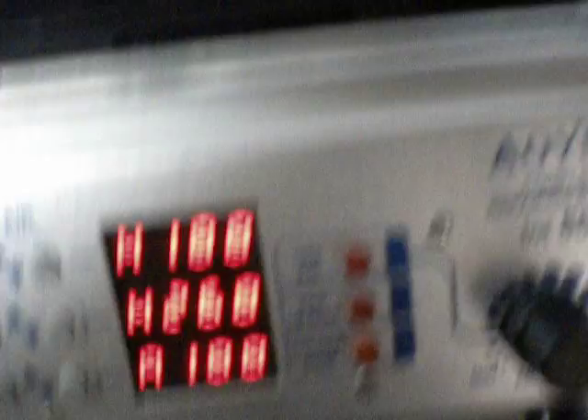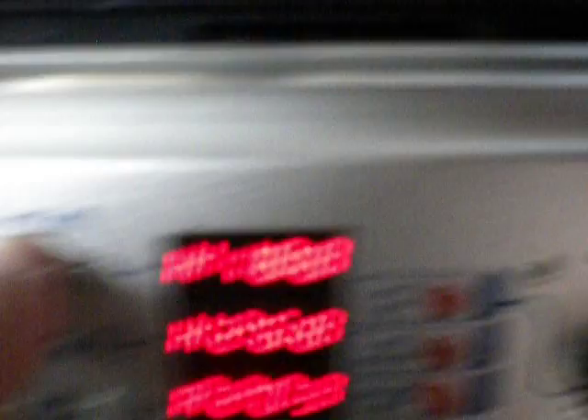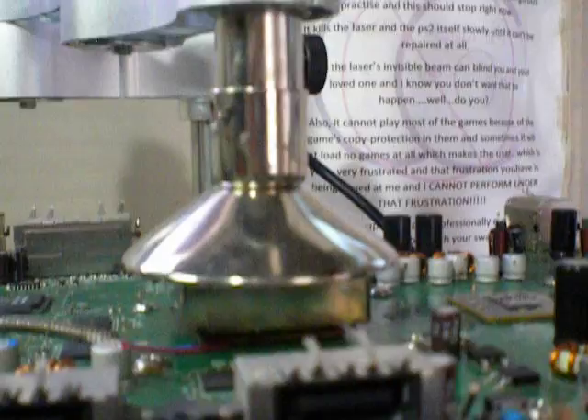The thing is you keep the heater on all the time for maximum flow. The temperature is at 188, so it's going to be fine. I'm going to turn it up again — now at 200. We're going to wait for this to reach 220. Just observe how the flux behaves. Once you see the flux in there it's starting to work really well. Still hard. It's at 209 right now and the temperature is dropping. I'm going to adjust the air pressure some more.